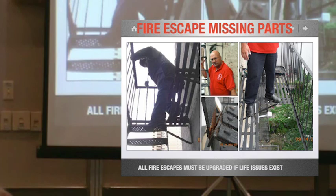By the way, your own weight is part of the load test, so how dangerous is this way of doing it? That doesn't seem too safe. To do a test like that, I wouldn't. I know, but that's what they want. That's the old way of doing it. We don't do that. I did this for the purpose of showing you guys the old way of doing it. You drag all your weight to the very top, 2,500 pounds on that platform up above, then start cascading some bags down the stairs. You need a bunch of men. You need all day.